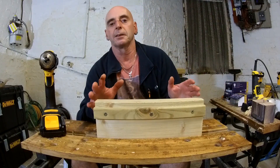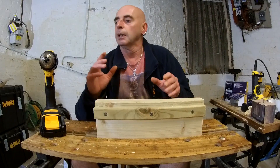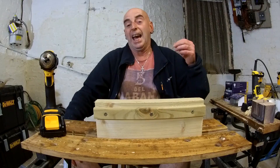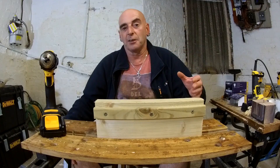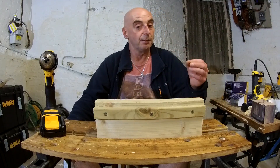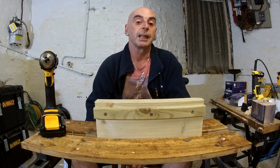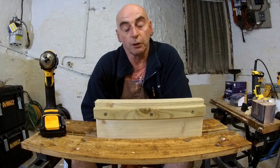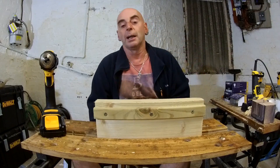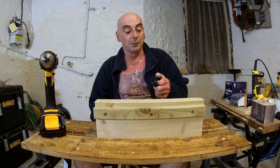Now hopefully I've explained everything here. As I said, just practice — go get a bit of wood, put some screws in, and learn. The professionals will tell you to do this on speed one, but with these new drills nowadays they're so powerful that speed two works. I find speed two with this system actually does work better — if you're a bit faster you can get things moving and if you've got the settings just right it'll work almost every time. Even I got caught out hitting a soft bit of wood. But trust me — professionals do not bury screws in wood, they'll always set them flush. My name is Milton — subscribe if you want, thumbs up or down, it's up to you. Bye now, see you next time.